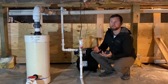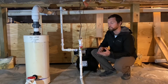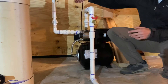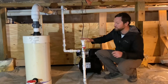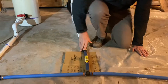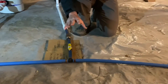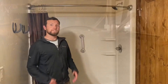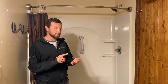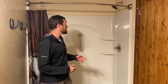The next important part of your rainwater harvesting system is a pump, and this is going to be very important if you want to use your rainwater inside of your house because you need good pressure. This pump is connected to an intake that is actually inside of the rainwater harvesting tank. When it fires up, it sucks water out of the tank and through these pipes. One side goes to our front yard so we can use it to water the front yard or anything we need there, and the other way connects to the house for indoor use. We get enough pressure to use the rainwater throughout our house — for our toilets, our sinks, our dishwashers, our washing machines. And just to give you an idea of how good the pressure is, I'll show you what the shower is like.